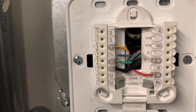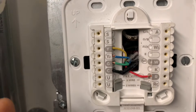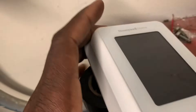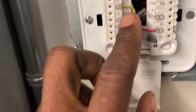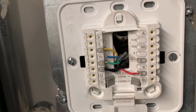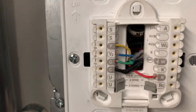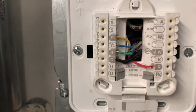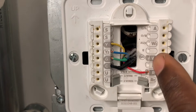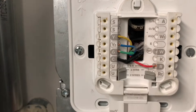Don't worry about getting electrocuted — this is 24 volts AC, which is too low to shock you. However, be aware there are line-voltage thermostats out there that operate at 120 or 208 volts; those look like older or specialized thermostats, not like this style. So be careful, do this at your own risk. To summarize: main power R, always use the fan wire with cooling or heating, and short R to whichever function you want to activate.